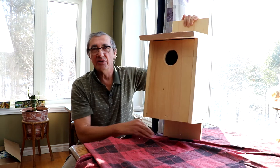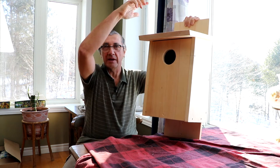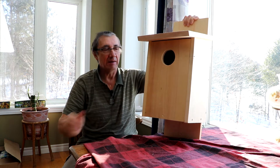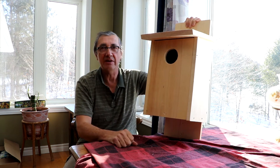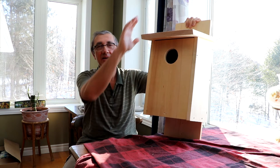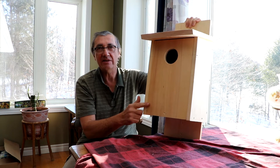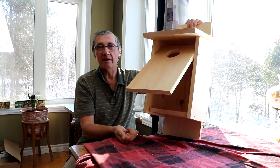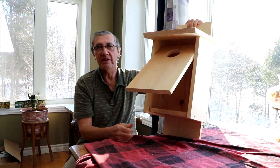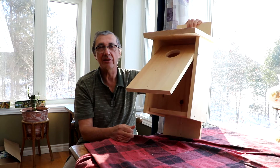The reason I did that is the original plan has a hinge on the roof to open it to clean it out. Because you mount these houses at quite a height to begin with — 10 feet or more — it's hard to sometimes get up high enough to open the roof. So I've made this design with a hinging front so I can open it at two or three feet lower on the ladder, which is significant when you're at those heights.